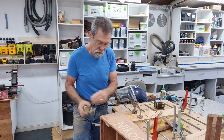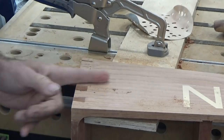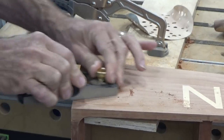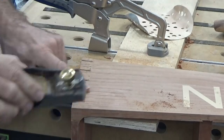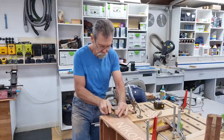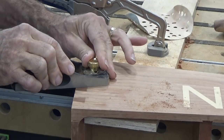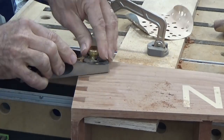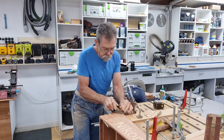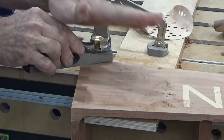If you were left-handed, you'd be starting from the other side and working in that direction. I'm making sure I'm not hitting the adjacent pin at all — not riding up on it, going along beside it. Keep a check on it. On the last one, don't be tempted to tip the plane over at an angle. Still keep it parallel to the surface.